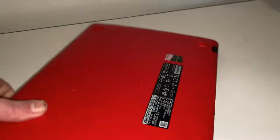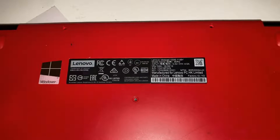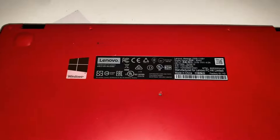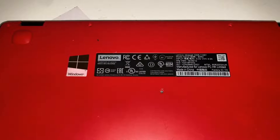This requires five volts and up to four amps, so I'm going to hook up my DC power supply to this motherboard to get power onto it, and we'll see if it powers on.